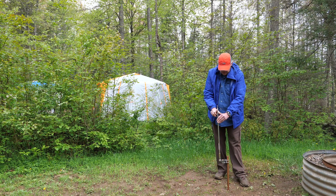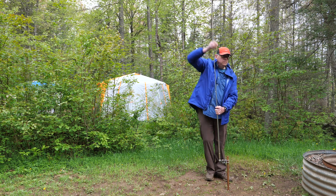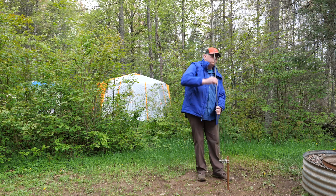I've used this a couple, three times now. What I found is that if I use my whip — just the whip itself and no coil — for 20 meters and above, my SWR is usually about 1.5 to 1 with no further adjusting. If I use the coil and the fully extended whip for 40 meters, my SWR drops down to about 1.2 to 1. So in a nutshell, it works really well. It's a fast deployment.